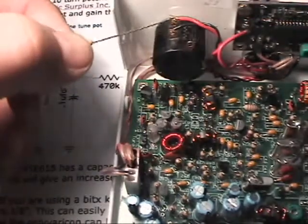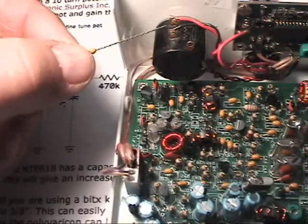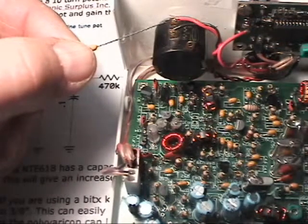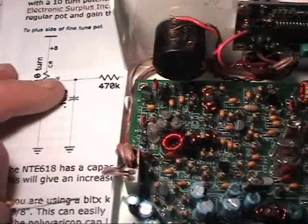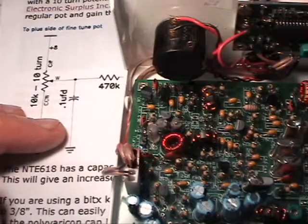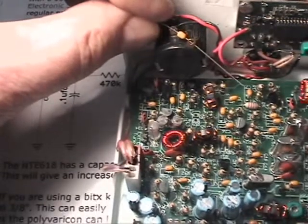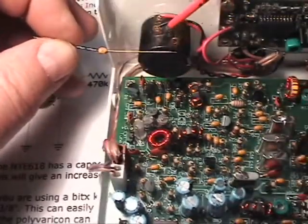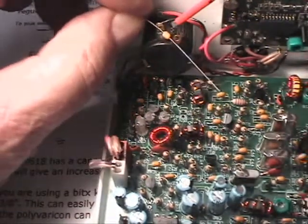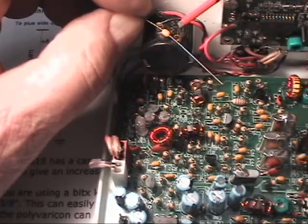We have the power hooked up here. We don't really want to solder these just yet because we may want to run some other leads through the same terminal. Coming off the wiper we've got a 0.1 µF capacitor to ground. That's really easy to do because all we've got to do is lay the capacitor across the two terminals — this is the wiper right here and this is ground right here — just stick the capacitor leads through the two holes, give them a little twist, and that part of the mod is done.